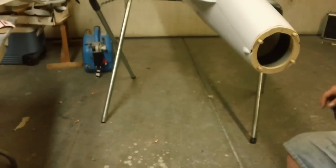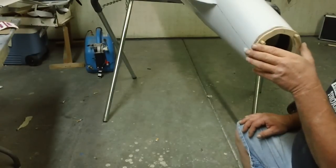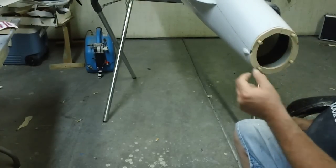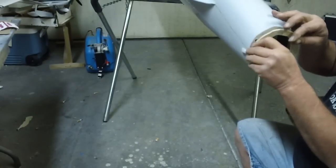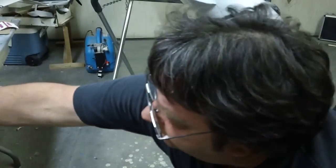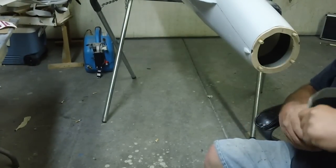This took a little bit of work. I took both these pieces out — I just had this piece tack-glued in, or just sitting there. I took it out and took some CA, held them together, and put just a couple drops around the perimeter. Then I drilled my holes for my dowel. Every time this goes on, it's going on the exact same way, same place, nice snug fit. Then I kept putting this on — I had to sand these ridges of resin and get her smooth.